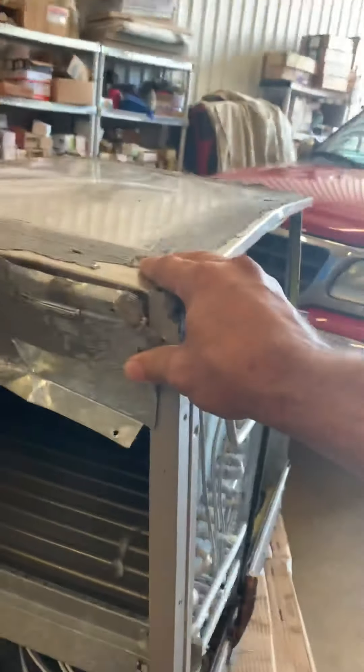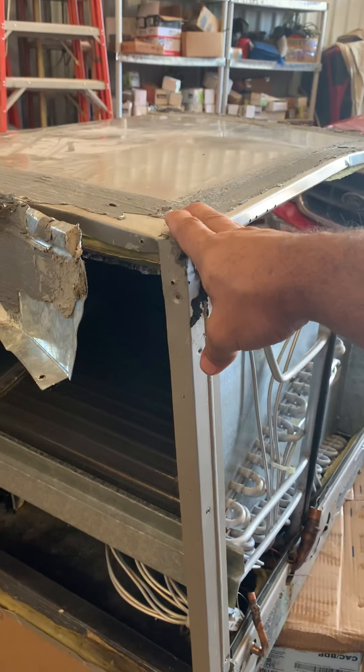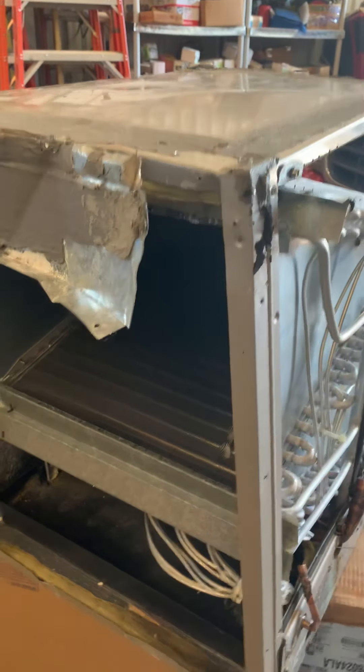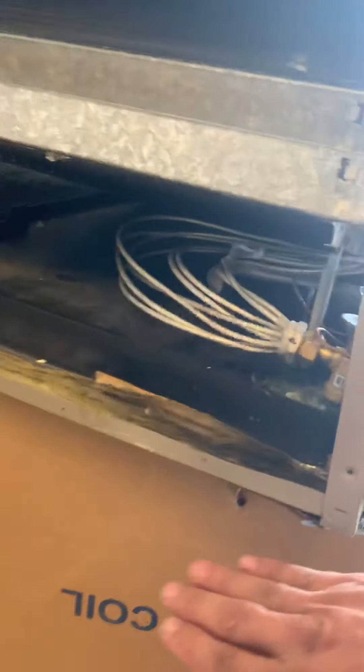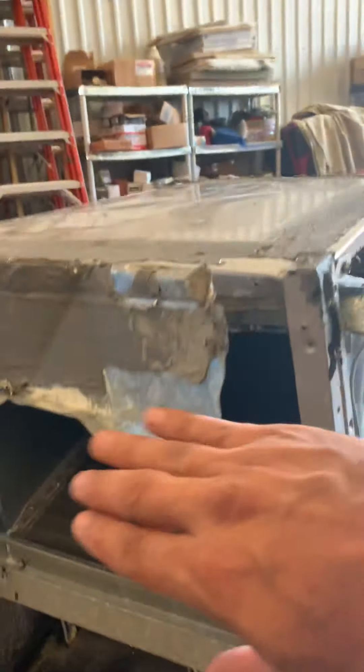The top part of this coil is blanked off because the cabinet for the coil is actually bigger than the cabinet for the furnace. So they lined up the bottom of the furnace with the bottom of the coil and blanked off all the extra space. In most cases, I've got to be honest — I was an installer for a very long time — you wouldn't think that would be a big thing. The airflow is still going to go across the evaporator coil.